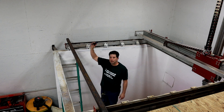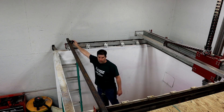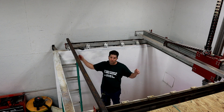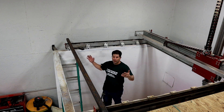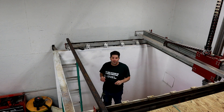Once that was accomplished, I took my laser distance finder that I showed in the other video and went corner to corner until I got it perfectly squared up. Once it was perfectly squared up, I made sure the bolts were tightened down, double checked it one more time, and then went in on the other side and actually drilled those holes for the support on that side. That makes sure the x-axis rails were perfectly parallel — and that was step one, prior to getting the gantry or any of the trolleys mounted.